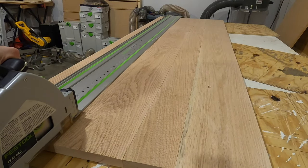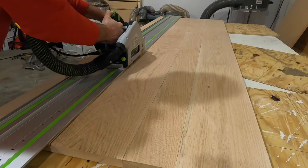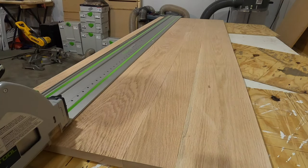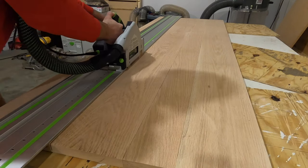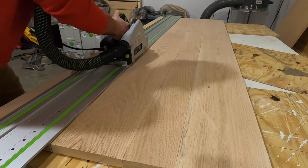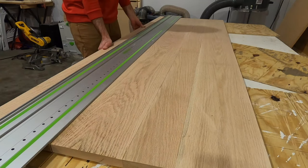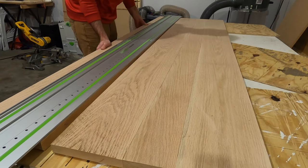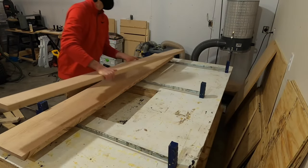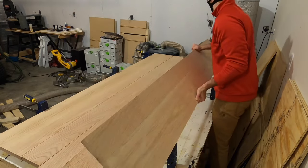Redoing work that I've already done is definitely not my favorite thing to do, but I figured it would be worse to finally get this table finished to the very end stages and have a few cracks running right down the middle. I grabbed the track saw and ripped right down the seams all the way across the board to cut those glue seams out. I made smaller passes and had to do this three times overall per seam. On the first seam the track saw actually bogged down and stopped a couple times, so rather than try to do it in one pass I set the depth a little bit shallower and made three passes overall to get through the entire depth of the board.